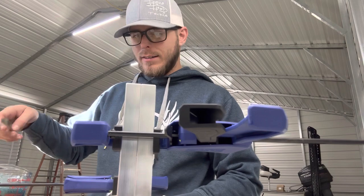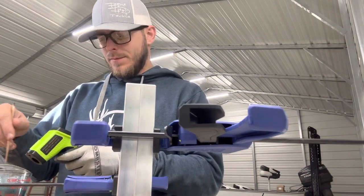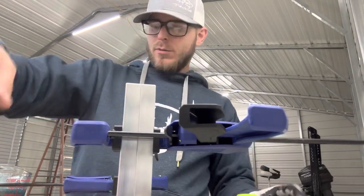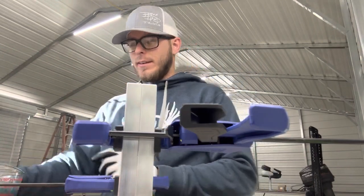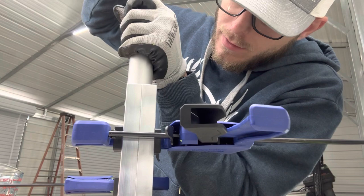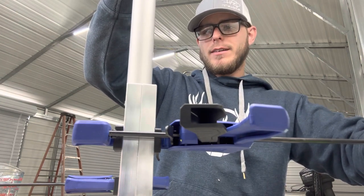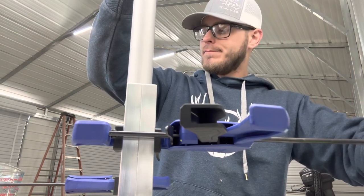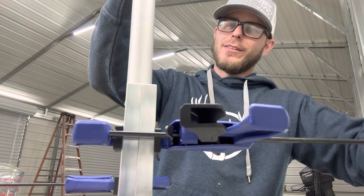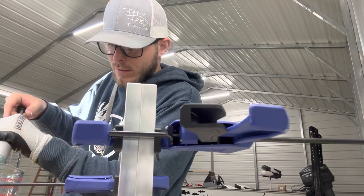We have it clamped down and our blue over here is nice and hot. You want it hotter than normal because you're going to be bonding to the existing plastic — you want to try to get around 370°F for that reason. Our plastic is at 375 degrees, which is pretty optimal. So we're going to draw some up and inject slow and steady. Okay, it filled up — we're just going to hold some pressure for a minute to prevent any air bubbles or denting. I think this is going to look good; I'm also going to shoot the purple over them too.